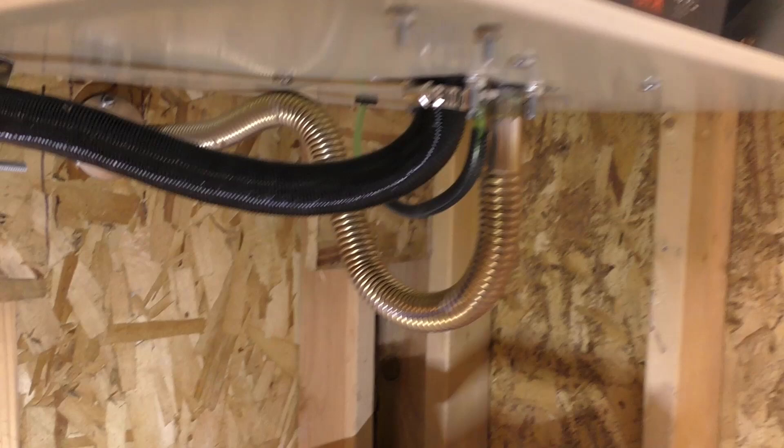Unlike a high efficiency furnace in your house, this exhaust gets extremely hot, so I assumed any moisture caught in that trap would be steamed out. But what I failed to consider is if a large amount of water came in from the outside flange — like if I power washed the siding — I could fill up that P-trap. When I took the P-trap off it was bone dry because it's winter and our air has the least humidity. But in spring when it's still cold and humidity is higher, I could end up with condensation trapped in there.